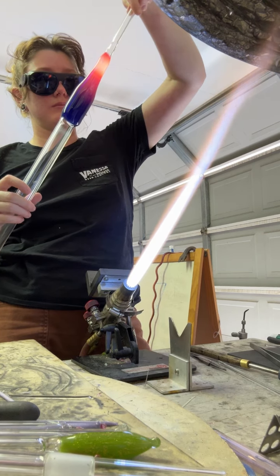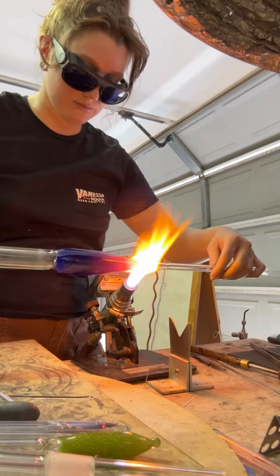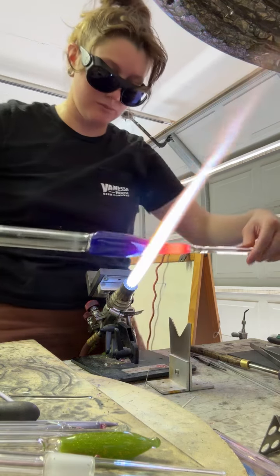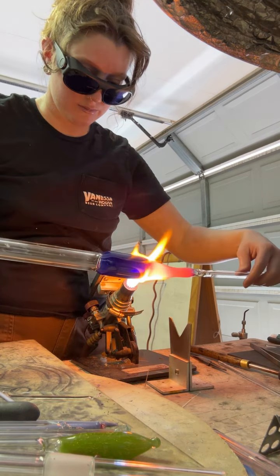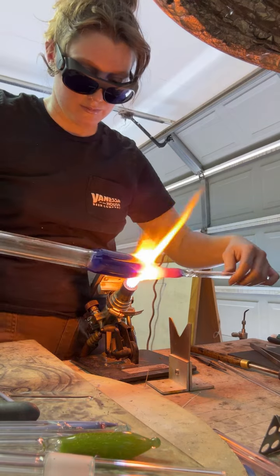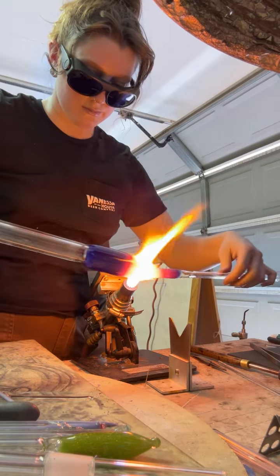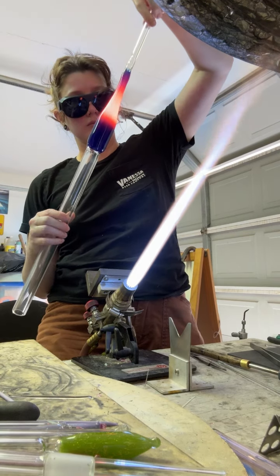So as you can see here, I've already encouraged that flare to pull back down closer to a 12 millimeter handle that we initially started with. And what I'm doing here is I'm working that last bit of that little hump of that shoulder down into the correct size that I want it to be to work with it. And here I'm taking a little bit more mass from the larger section and incorporating it or pulling it down into the thinner section so I have a viable piece of tubing at the length that I desire to then create something from the pull.